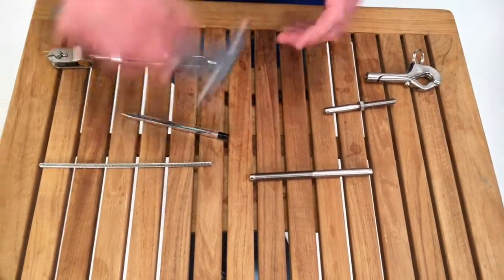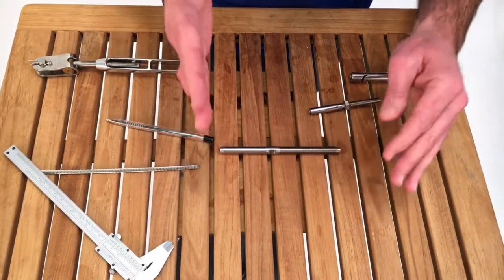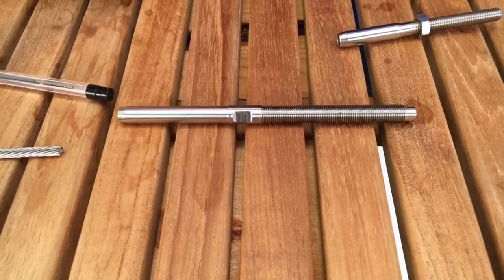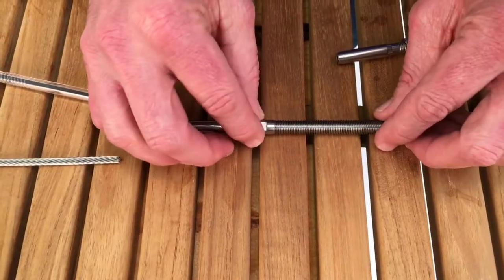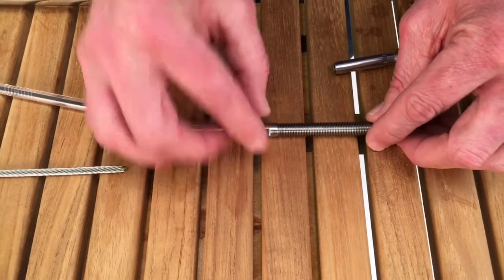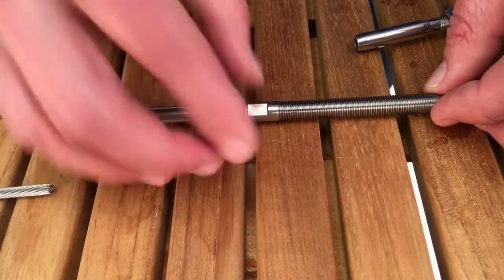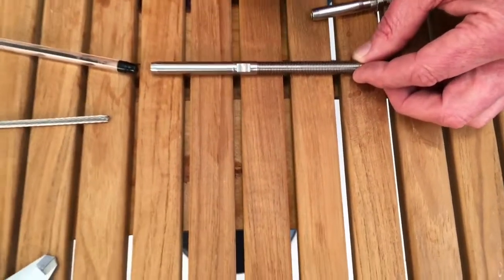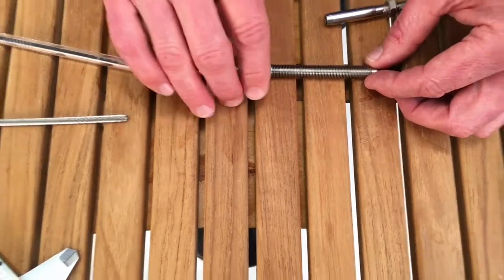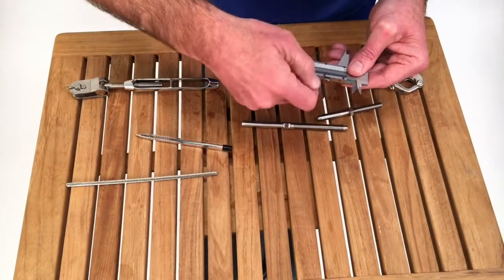This one's a bit tricky — this is the thread hand, meaning left-hand or right-hand: which way do the threads go? In this orientation you have to look carefully, and sometimes you have to rotate it and see where the thread starts and goes. In this case I can tell it is a left-hand thread, not a right-hand thread. That's my third specification.